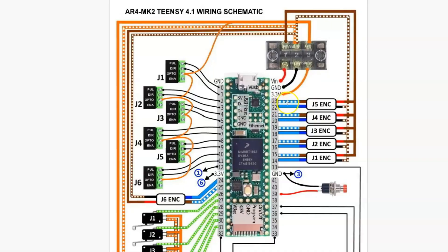The blue stripe and blue solid wires connect to pins 14 through 23, so we'd want to check those connections all the way through to the encoder. Then we'd want to make sure that each encoder is getting a positive 5 volts and a ground, and check those signals back to the distribution block.